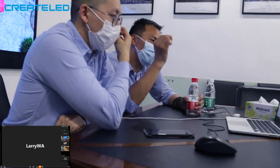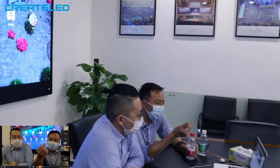The cost comes from the PCB. As you know, for PCB, the pad size and quantity need very, very high accuracy, because the chip size is so small. Like SMD 1010, 1 millimeter by 1 millimeter. But for flip chip, the pad size is very small. So the PCB quality requirement is very high, and that's why cost is very high at the moment. And we need volume, so you need good robots to do the job.